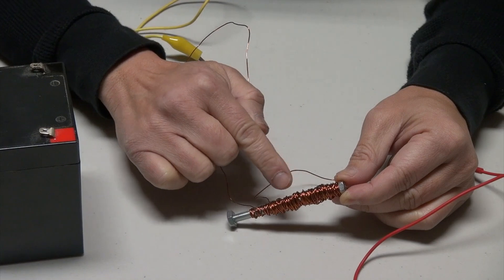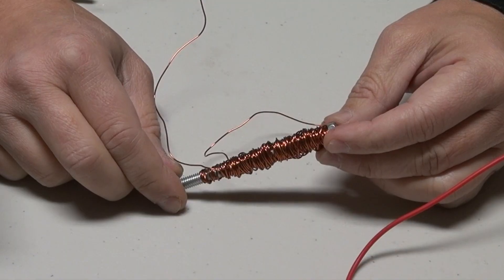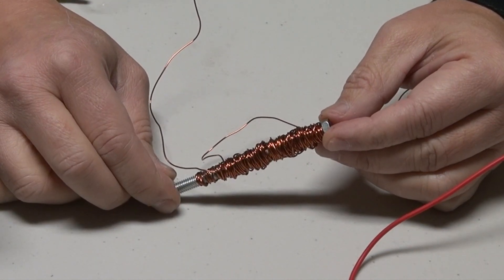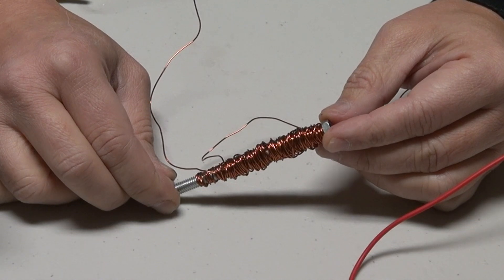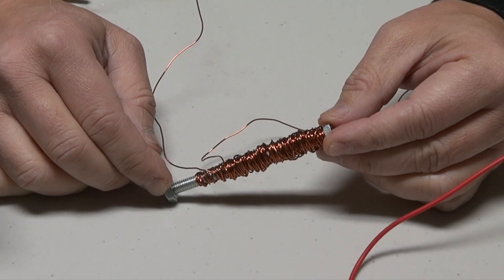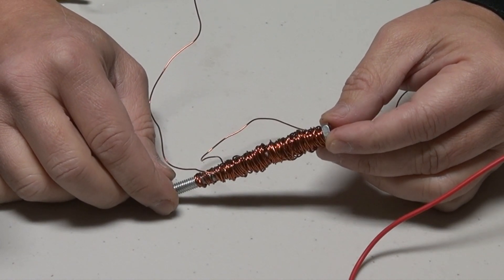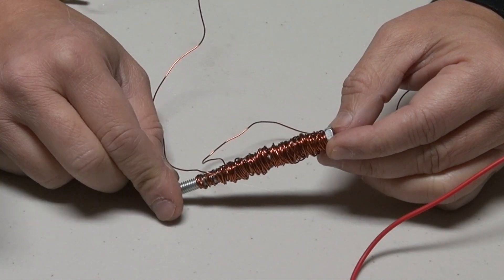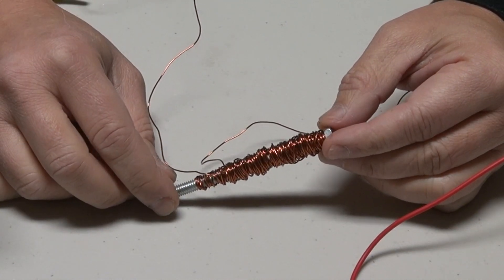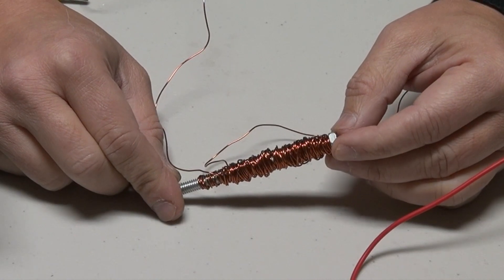By doing so, the magnetic fields are combined and consolidated, therefore generating stronger magnetic fields. Here I have a steel rod. It turns out that steel and iron have magnetic domains at the atomic level; however, these domains are dispersed and don't align correctly to enable the iron to act like a magnet. But when you bring a magnetic field closer to it — or when you magnetize the iron — their internal magnetic properties align and they effectively become a magnet. When you take the magnetic field away, they return to a normal state. This is the basic concept of an electromagnet.